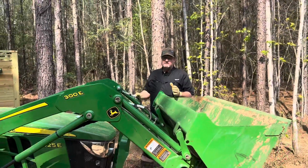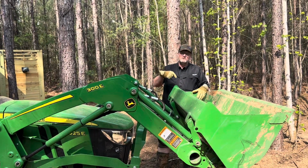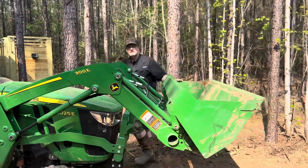All right, after you do that, all you have to do is get in the tractor, tilt your bucket forward, set it down, and then lower your rams, and you can back right out from underneath it. I'm gonna show you that right now.